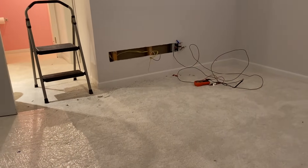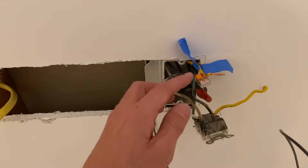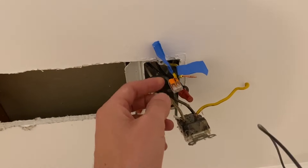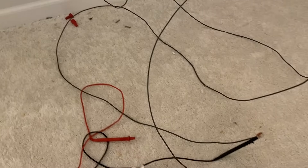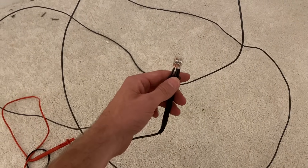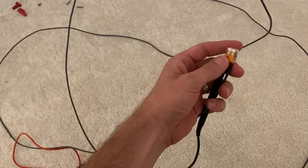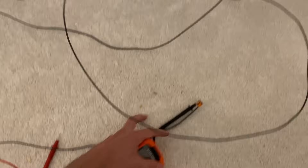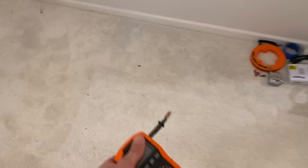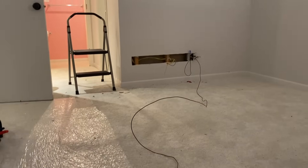I want to know which one of these yellow wires goes over to that outlet — that's where the extra cable comes in handy. At this outlet I have what I believe to be the yellow wire going into one of these lever nuts, and then my black extension wire all coiled up. The lever nut is handy because you can put the probe and the wire in there, close those down, and it'll secure them together. You can use the negative or positive side, black or red — it doesn't matter. The multimeter and extension wire together give you the reach you need to do the continuity check.